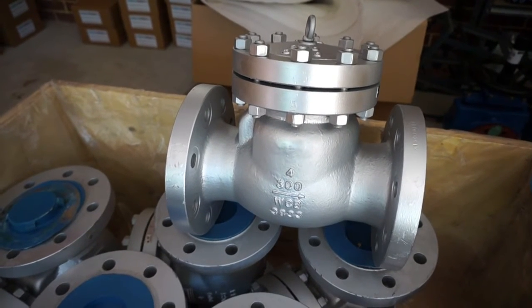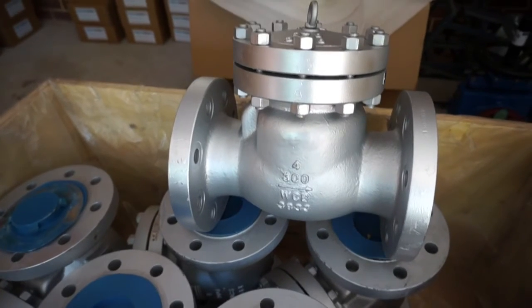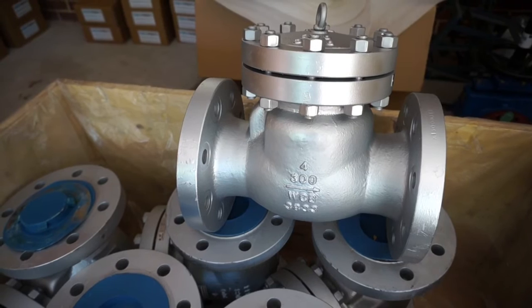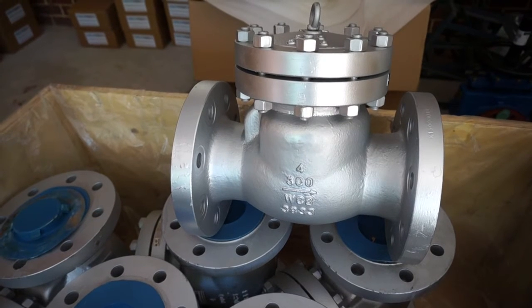The pin is 410 stainless steel, the shaft is 410 stainless steel, the gasket is 304 stainless steel, and the disc and seat ring are made from a hard chrome compound steel — a hard chrome steel seat.